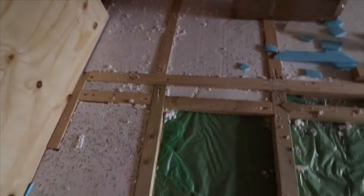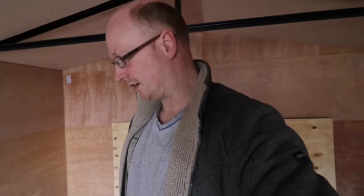So as you can see, it's quite important that you insulate the floor because it's going to be cold concrete. And we need to have something as a barrier to keep the room warm. So I'm using two types of board. This is XPS foam. It's very similar to a polystyrene hard board. It's very dense and very hard and it snaps easily.